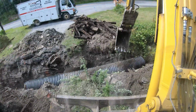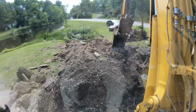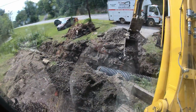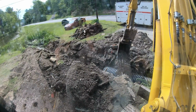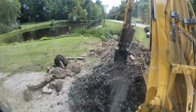If you let it land on top of the culvert pipe, it'll give both sides and not want to roll it. You don't want to load it up on one side. You'll roll it and lift it right up. Also have your bell end facing the water flow coming in, so you can always add to it, and that flashes the pipe also.